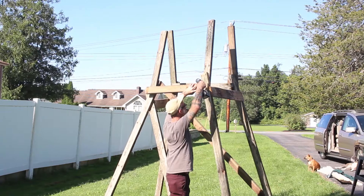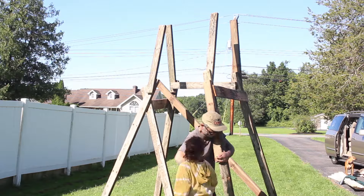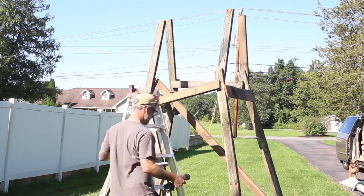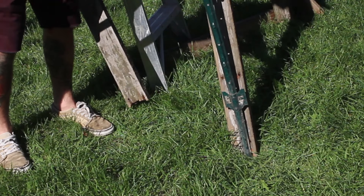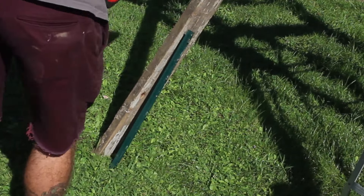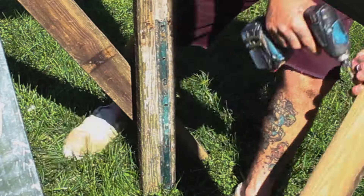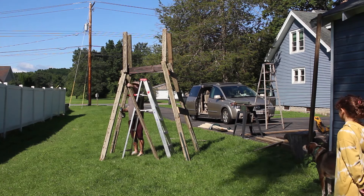Once I had these standing up I brought over my other 2x4's, also with a 4-foot piece of pallet wood screwed to them. I only put one screw in each side of these pallet boards so I was able to pivot the 2x4's once they were leaning, then used another 2x4 to help hold it all up. I should have done this before picking it up, but anyway — now with everything standing, I grabbed some garden fence post spike things from my shed, hammered them into the ground right next to the 2x4's, and screwed them together to keep it from falling over. Then I nailed random boards across all four pieces so they would all support one another, and removed the temporary support 2x4's.